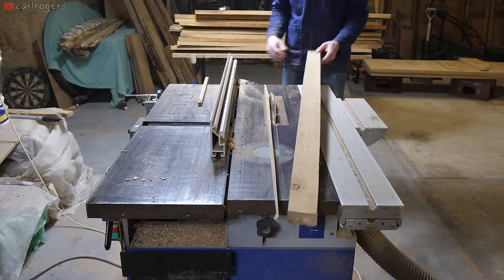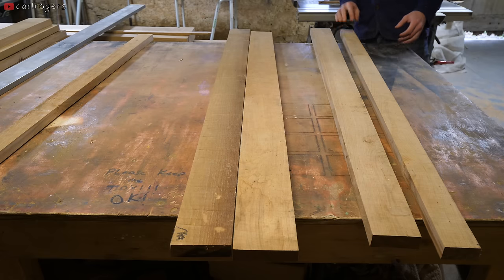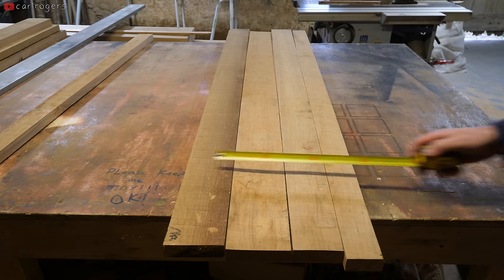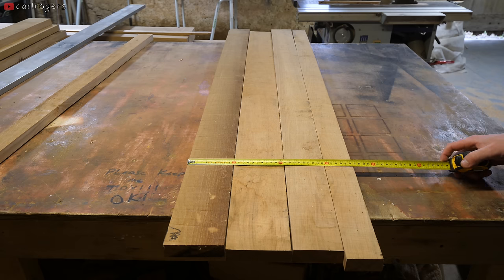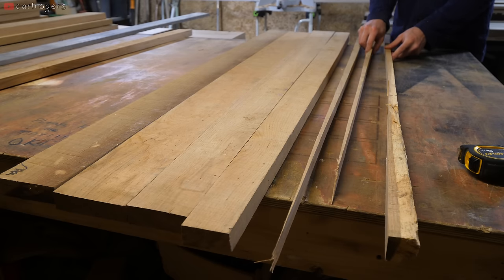Sometimes you'll then end up with boards that taper towards one end, which you can then match against a board tapering the other way. Abandon the idea of parallel boards for the time being, you can fix that after they're glued. It's very slow, but because of low waste, this is probably the most efficient method to get the highest volume out of your planks.